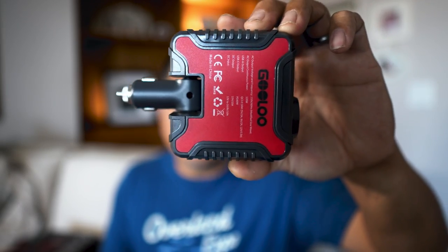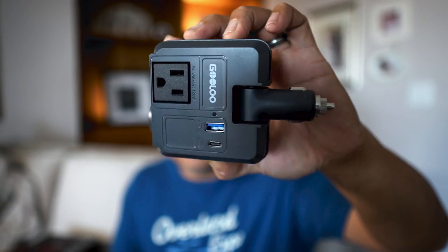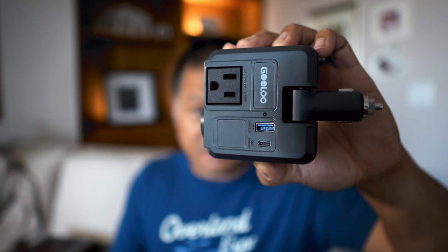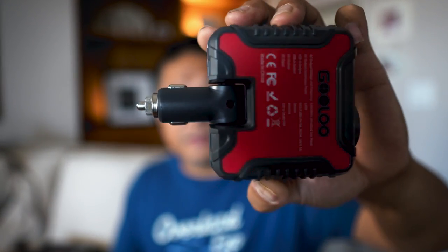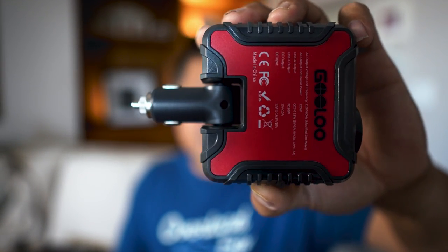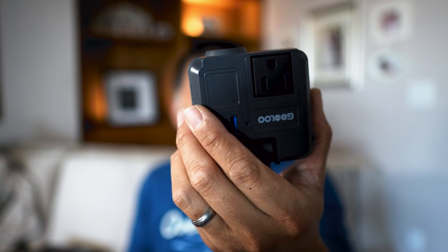This is the AC inverter unit. It's a separate one that plugs into the cigarette lighter outlet and can power up to 120 watts. Even though this power station has an output rating of 150 watts, the 120 watt rating is because it's using the cigarette lighter socket, which usually has a 10 amp output rating. The way that it works is that you just simply plug it into the cigarette lighter and there you have a power station with full AC inverting capabilities. This is, however, just a modified sine wave inverter. With this size, you're not going to find a pure sine wave unit.